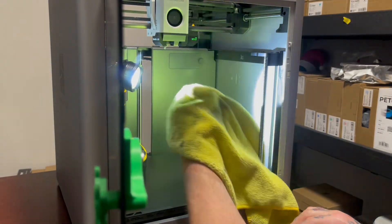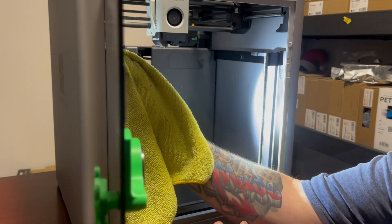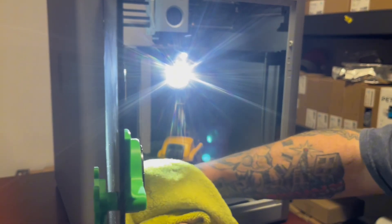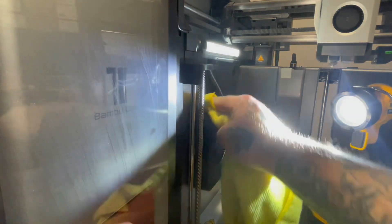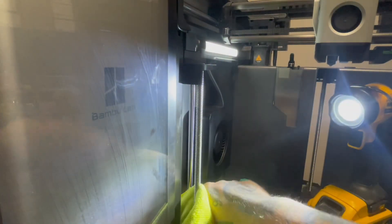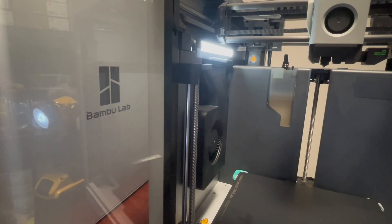And that's with me venting outside — just imagine if you don't have ventilation what it looks like. It's nice to keep them clean so you're not running into problems. I'll clean up really good on both sides. That other one is really dirty — wow, extra dirty this time. I did print with ABS but I didn't go crazy with it. Maybe some of the filament was older. There's definitely white dust in it. When I took it out to blow it out, I already cleaned this fan, so I'll just wipe it off while I'm in here.